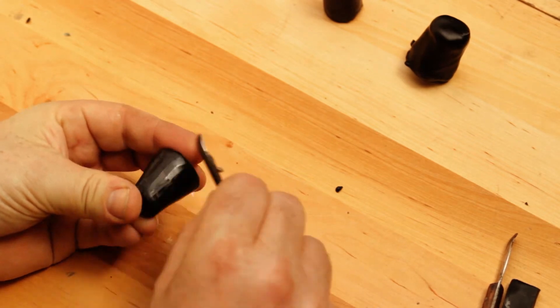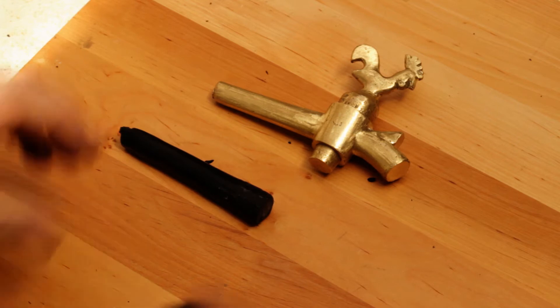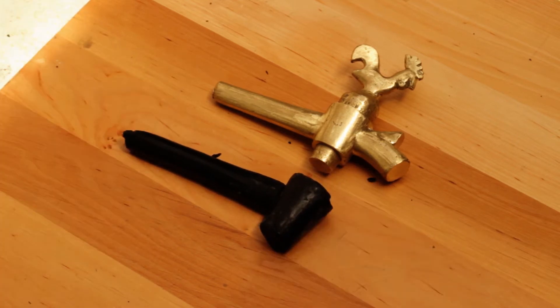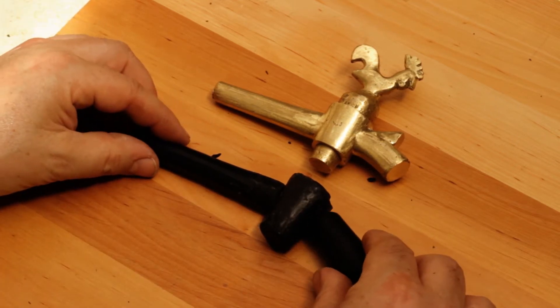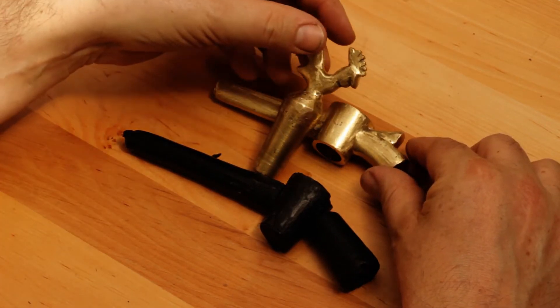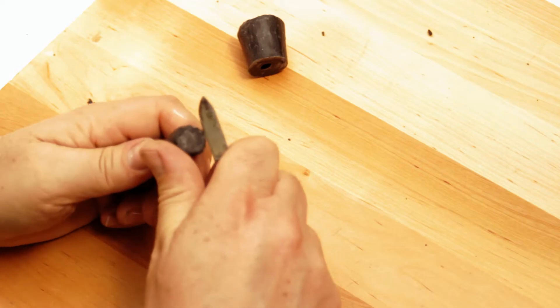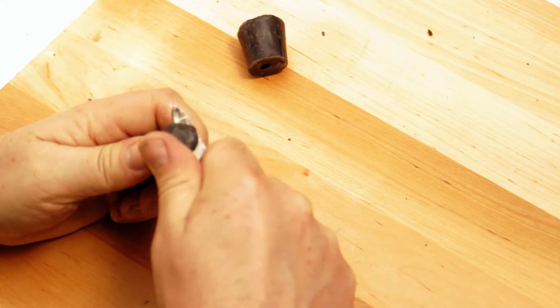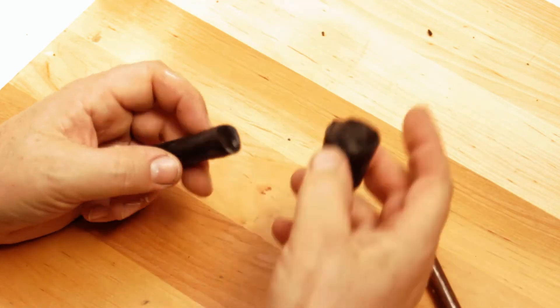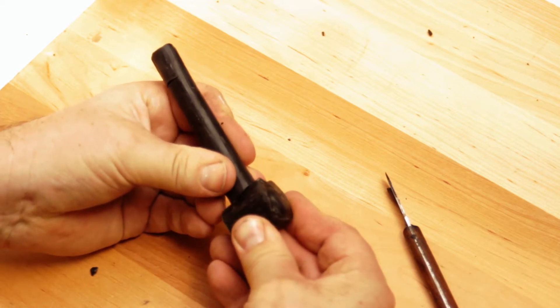This tap consists basically of three cones, and I am showing several ways to make those. They can be modelled and scraped, or cast in simple plaster moulds to facilitate more efficient production. Wax can be shaped by virtually any method known to us — it can be modelled, sculpted, cut, sawn, filed, rasped, scraped, cast, welded, rolled, pressed, or stamped. Thus it is possible to create almost any shape imaginable in wax.